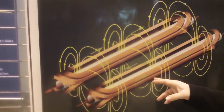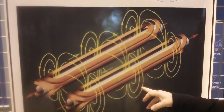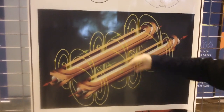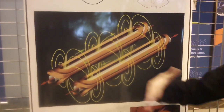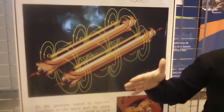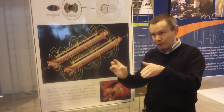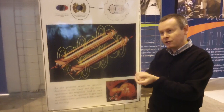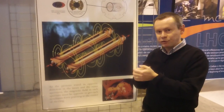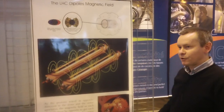There are very strong forces because the magnetic field is strong and the current is very high. The coil has a tendency — if you let it go — to try to become a round circle, pulling itself apart with great force. Everything has to be mechanically held very tightly, and when there is a small movement you get the loss of superconductivity and a quench. This is quite a difficult technology.